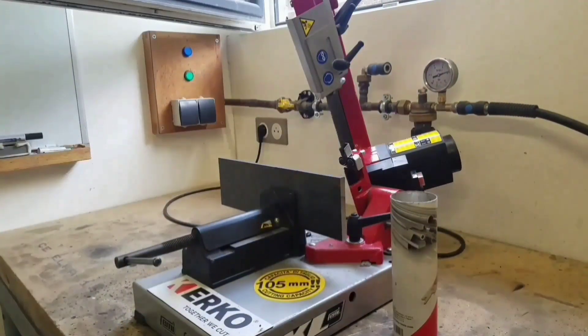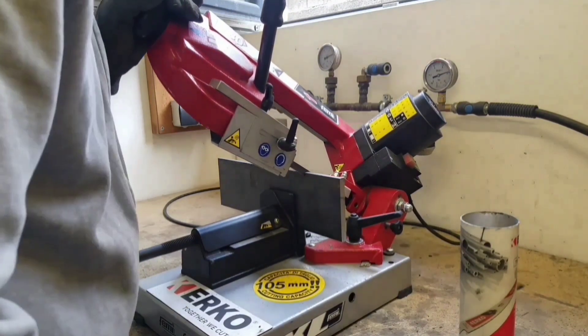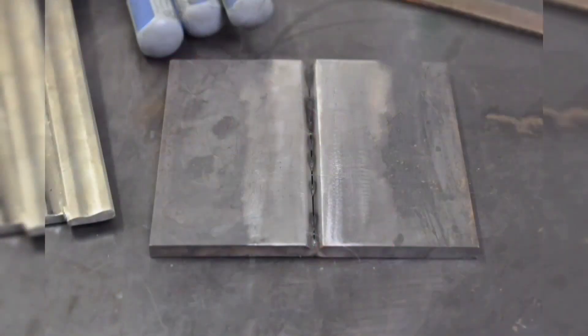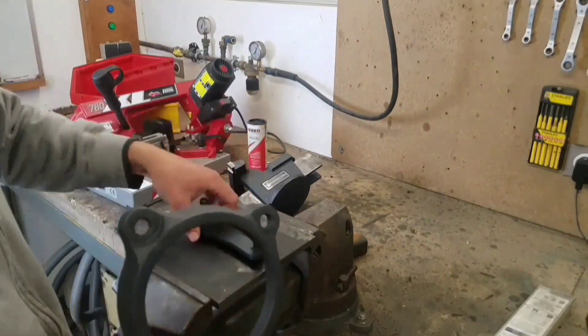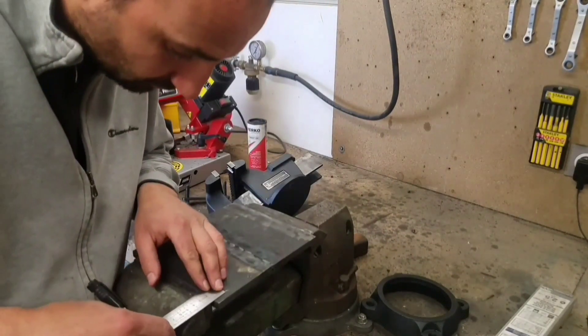More cuts, this time for the removable vise — the support will be made entirely from off-cuts I had, but it works very well. The side facing the plate I tacked, then ground flat to make sure it's perfectly plane, clamped to the plate to avoid any deformation, chamfered and cleaned up — now I just need to make nice weld beads. I'll fix the vise on the plate I welded to check if everything fits well.